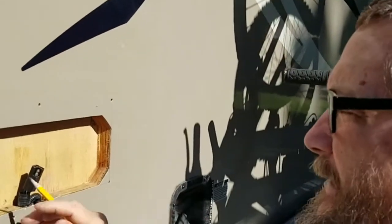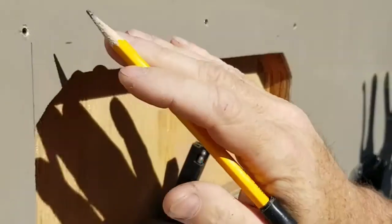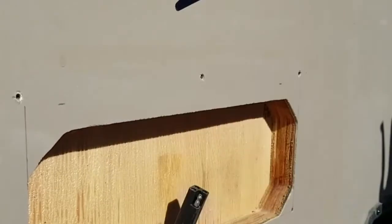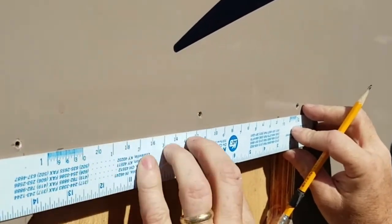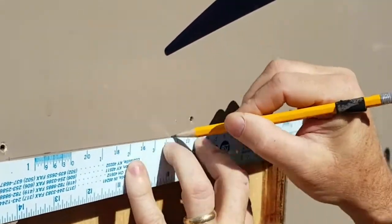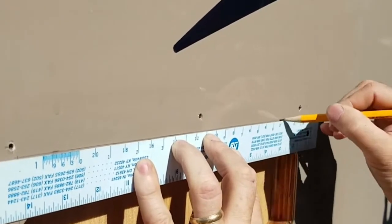The new LED lights — the outside bolt pattern is the same, the outside size is the same, but the lights themselves take up more room. So you end up having to actually cut a little bit out of the existing hole opening, about a half to three-quarters of an inch — mine's about three-quarters, maybe five-eighths.